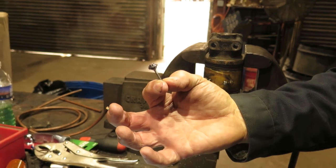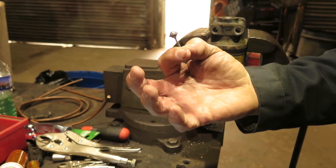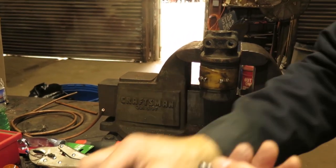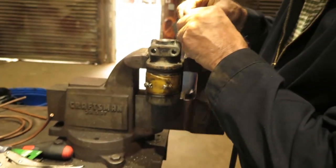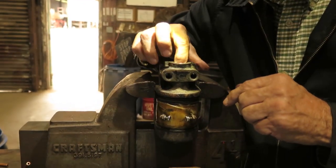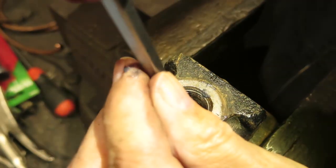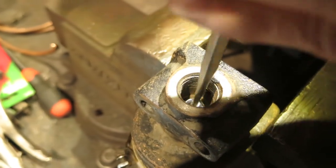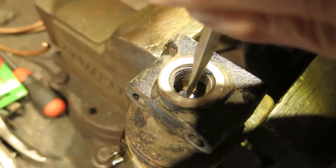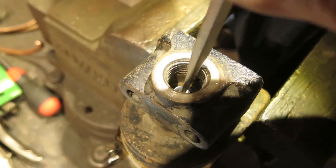Okay, that's the needle valve. That's what they call the lower seat. So this is closed when the magnet valve is de-energized, and I've got lapping compound on it. That's this. Put a little bit more on, and we'll drop it back in like that. And we'll put our screwdriver on it. They conveniently put a slot in for this very purpose, and we lap it in. Again, this is the one that's pretty good. The one on the other side is not.